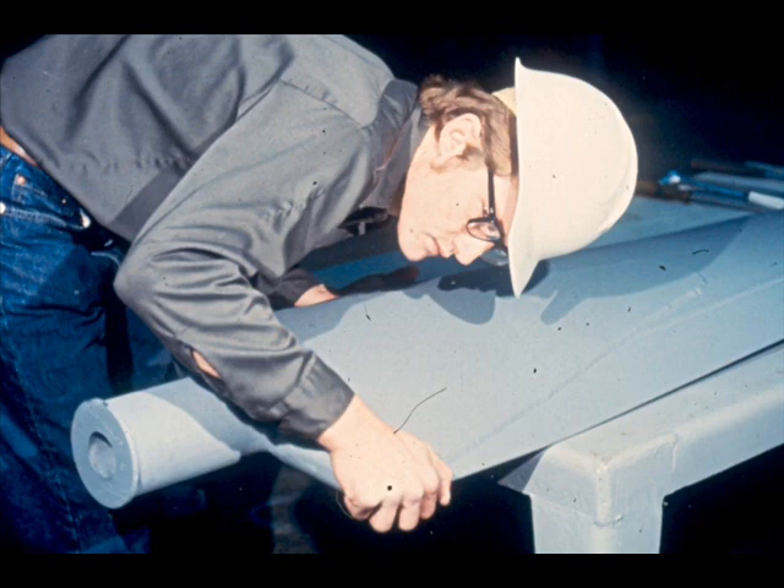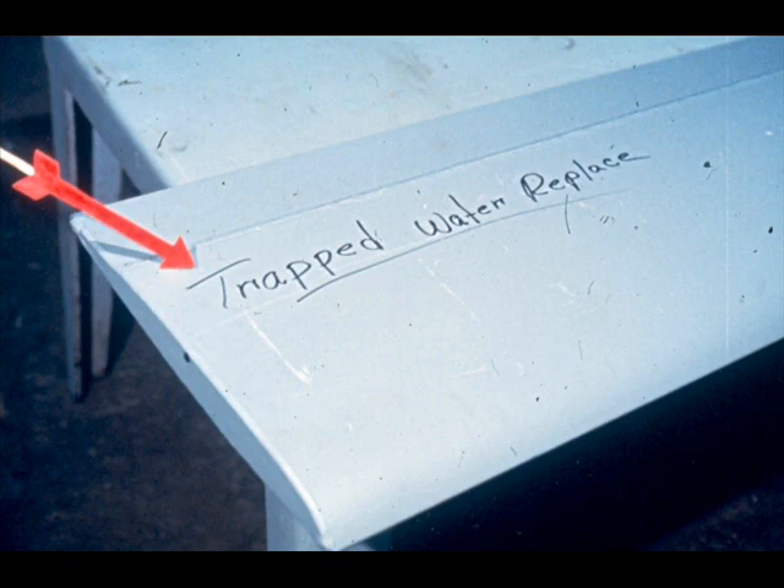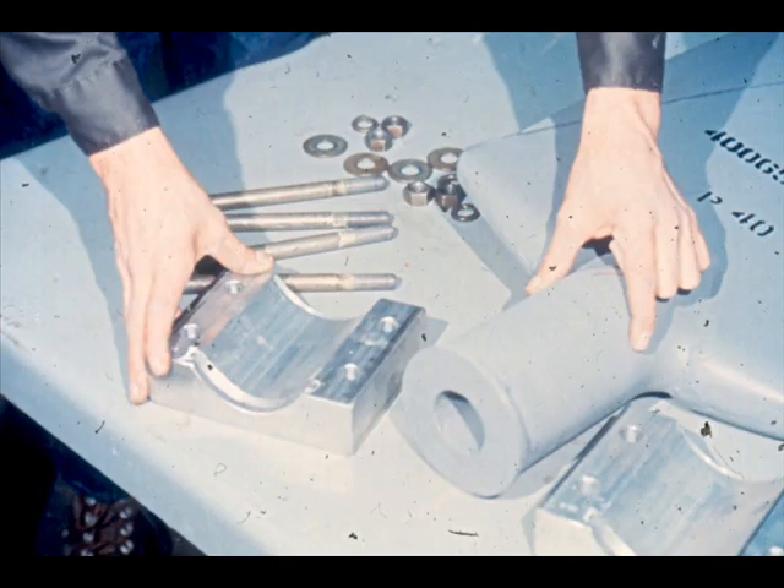Here's something else to watch for. If your fan blades are hollow, check to make sure that there is no water trapped in them. If there is water in the blade, it must be drained, or the blade must be discarded. Older blades were sometimes manufactured with a drain in the end of the blade called a weep hole, which could be used to drain the water. However, if your blades have no drains or weep holes and there is water trapped inside, it will be necessary to replace the blade. Water trapped inside a fan blade is usually evidence of a crack somewhere in the blade. Don't forget to inspect the blade shanks for excessive wear or damage. Also, check the shank fit in the corresponding retention socket to ensure smooth and even mating surfaces.